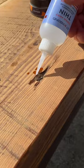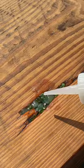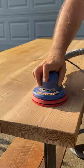Instead of standard wood filler, we're gonna try this new stuff from Starbond — it's like tumbled glass in various colors. You use thin CA glue, wait a few minutes between coats, don't activate it just yet, then come back about ten minutes later and sand it flush. Definitely want to layer that CA glue and take your time. A little mineral spirits to see the color.